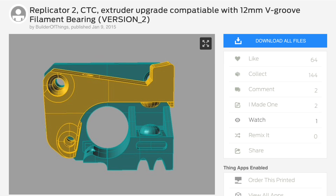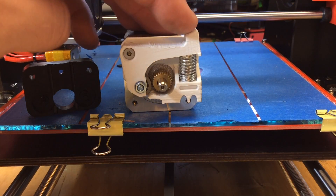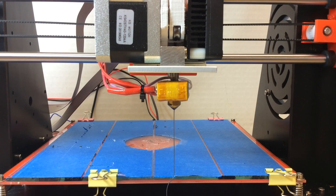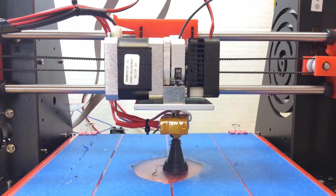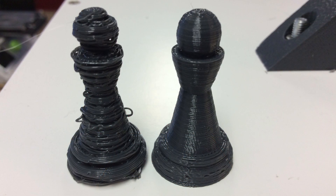I shared the issue with my Patreon supporters and Ray Pope suggested I print an upgraded extruder part. I quickly printed it at a rough setting, put it together, and was already loving it — it was extruding plastic properly. I set it to work printing in time lapse. It's not a perfect print since I didn't calibrate the flow and there's no cooling fan for the filament, but what a difference — just a 3D printed part made that big of a change.